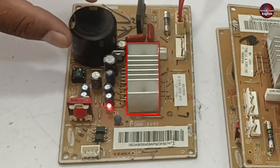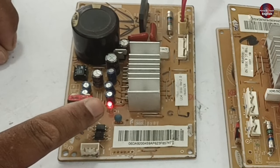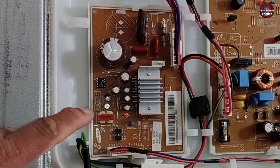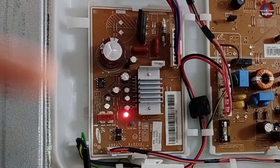The IPM of this PCB board is also okay with no issue. However, its light is constantly glowing, which means this PCB has a problem — because the light needs to glow one time and, after a few seconds, needs to stop glowing in normal condition. When the compressor starts working, then the light glows continuously in this PCB.